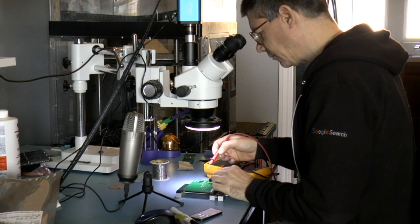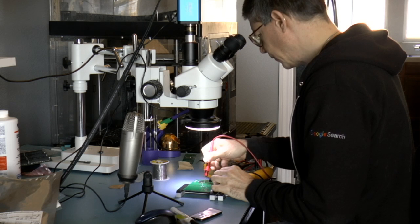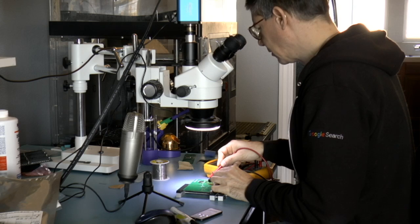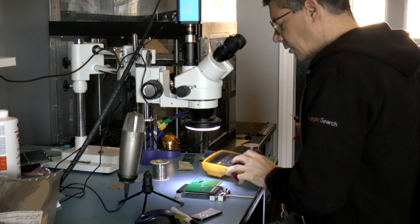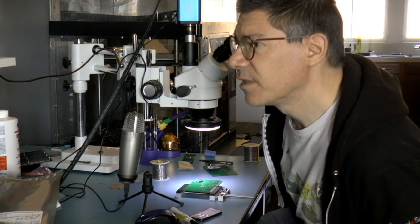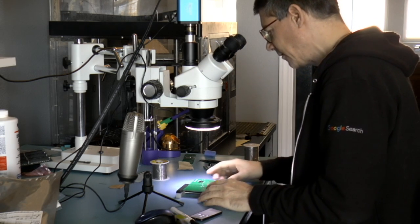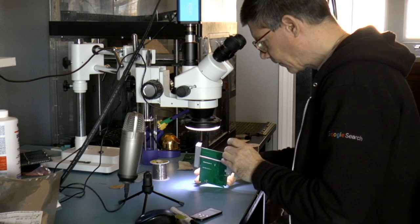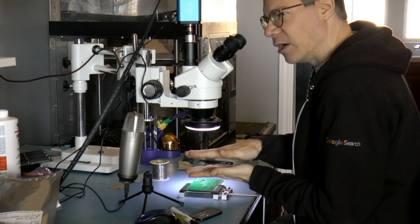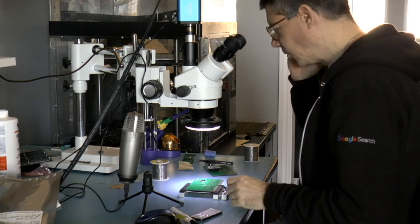So I'm going to connect the ground lead to ground, the positive lead to positive, and I get nothing. And if I swap the leads, I get another protective diode of 0.43 volts. Great. So I think this actually worked. The component sinking down to the PCB was nicely observable. That's great. I'm glad that you could actually see that, because that really sort of hits home that the printed circuit board on the module just sort of presses down right onto the board. So that's cool.